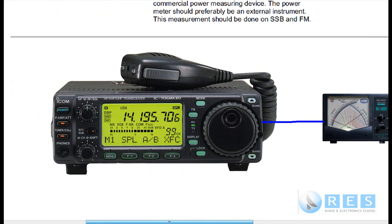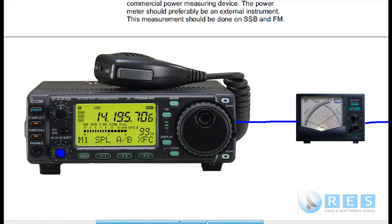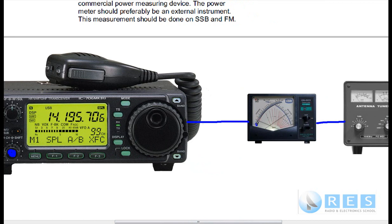So what do we do? If we're going to do it on air, we need to follow competency 10 — listen to a frequency we're allowed to transmit on and ask 'Is this frequency in use?' a couple of times. If it's not in use, announce your call sign: 'This is VK4FABC testing.' Then while you're counting you would adjust the microphone gain control and look at the watt meter. On this meter, forward power is measured on the left scale, reflected power on the other scale, and where they cross is your SWR.